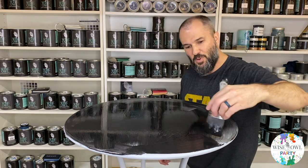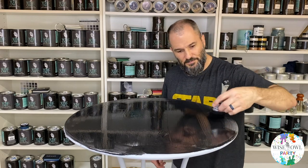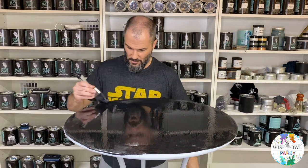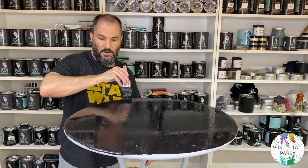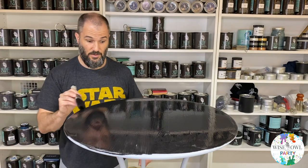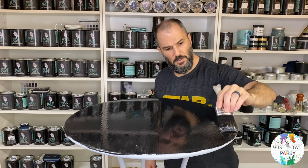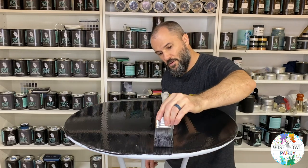It's just like pretty much all of Wise Owl's paints and varnishes — it self-levels really well. You're going to want to get it on and then just feather it out. Because it is a one-hour enamel, an hour from now I'm going to be able to come back and do my second coat, which you'll obviously need to do because a little bit of the gray is peeking through. I want only black to show through my metallic when I'm done. You're going to think, 'oh man, look at all the brushstrokes' — but you'll come back and it's going to be flat and glassy beautifulness. It dries with more of an eggshell finish because it has that built-in top coat, so it's a unique finish as well.